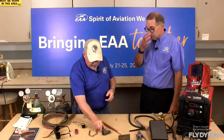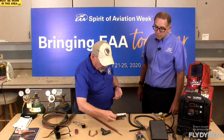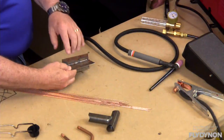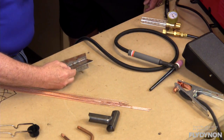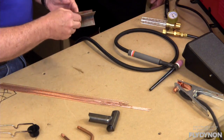There's a tremendous amount of technique that comes from practice. When I start showing people how to weld, I'll start not even with a joint but just a flat sheet of metal and have them run a bead — just making a weld puddle and getting the feel, practicing melting the metal. Once they get comfortable with that, take two sheets in a butt weld. Then give them a T weld, and then start working on tubing — first a simple weld, then one at an angle, and then later a cluster. There are all different kinds of basic joints; you start with the simplest, which is no joint at all.